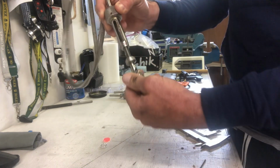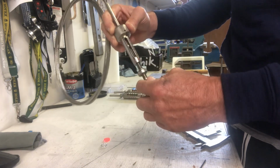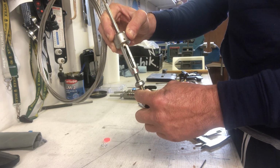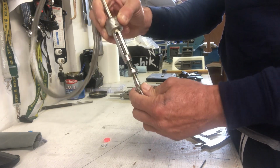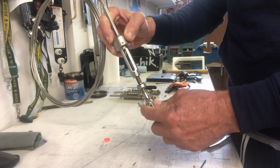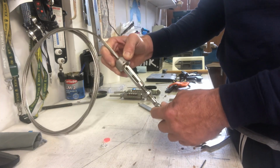You can see a lock nut with a spring washer to safely lock off the turnbuckle when you're happy with your settings, to ensure it doesn't unwind when not under load to leeward. So yep, really nice product. Most Etchells would have been fitted with these over the years.